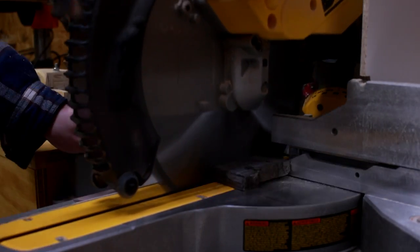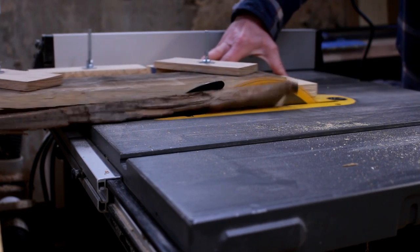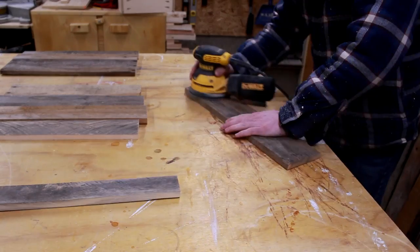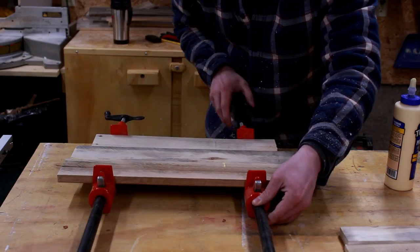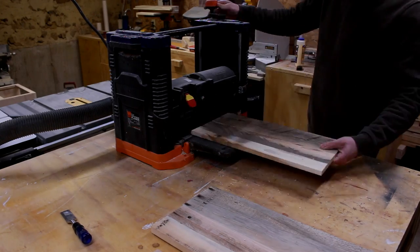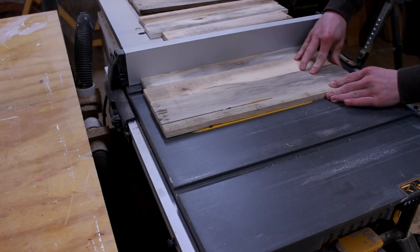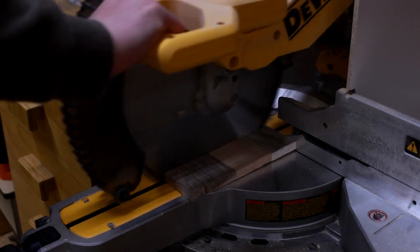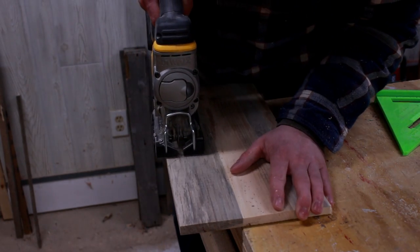For the drawer fronts I used more pallet wood cut down to rough size. I used a jig to get one straight side on each piece of pallet wood, which allowed me to cut the opposite side by running it through the table saw. Once I had my drawer faces lined up to rough size I followed the same process as the desktop — sanded them down and ran them through the planer. I then glued them up, making sure the front facing side is as flush as possible. When the glue dried I ran the back side through the planer to flatten them and get them all the same thickness, then cut the drawer fronts to their final dimensions using a table saw sled and stop block on the miter saw. For the drawer pull I cut a notch on the top, using a template so all three drawer notches match, and cut them out with a jigsaw.